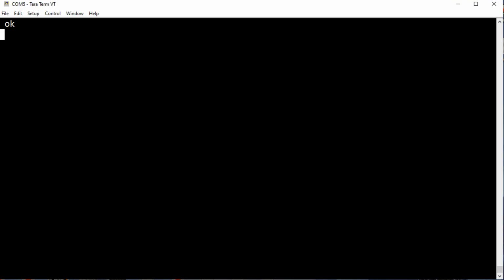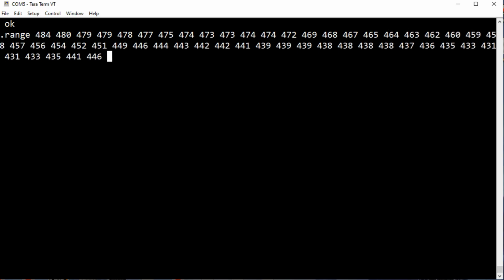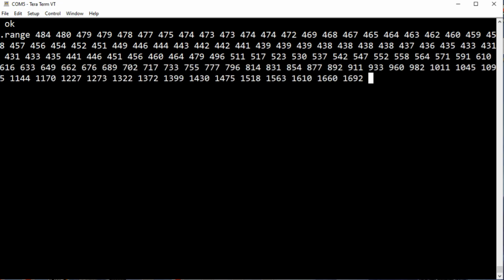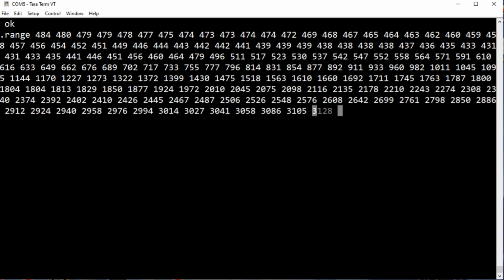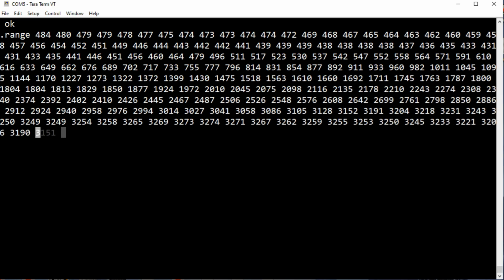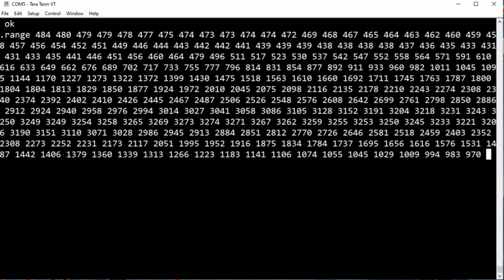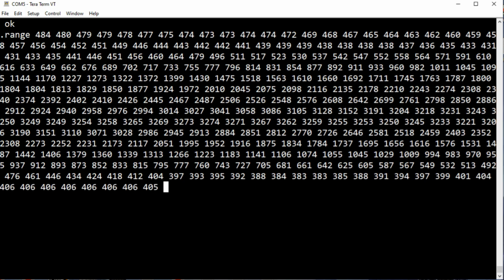Okay, next, we're going to have a look at our Y value. That's our range. That's our distance to target. So I'll go print range. And I'll get up and slowly move back. And it should increase as I move further back. Stop. I'll come forward, back towards the sensor, and the value should drop. So I come closer and closer, and we're back at the sensor.